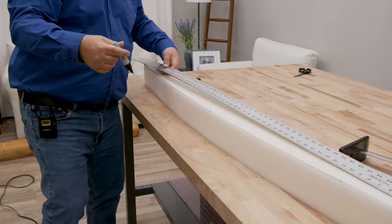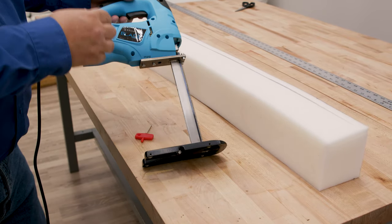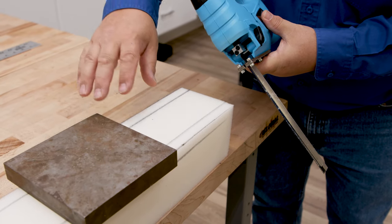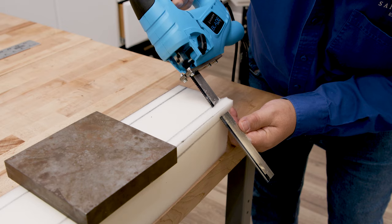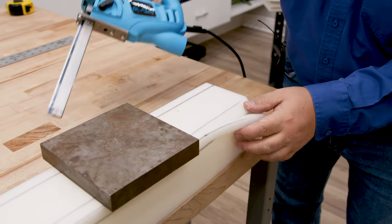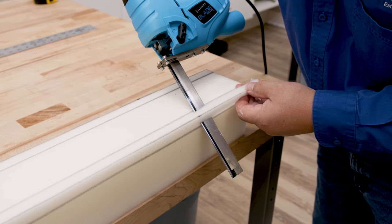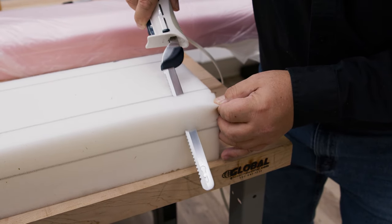So there's one corner — I'll do the same thing to the other one. You can take the base off the foam saw, which is helpful for this kind of cut. Put the base on the floor and wiggle it with your shoes on so you don't get cut — the base comes right off. If you don't have a professional foam cutter like this Sailrite Blade Foam Saw, you can use an electric kitchen knife as long as your foam is not high density.